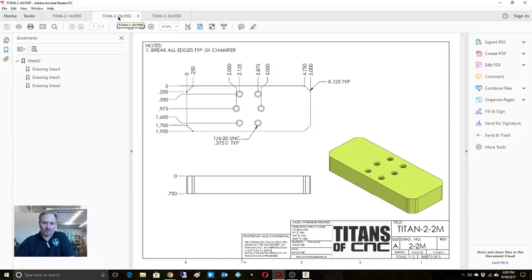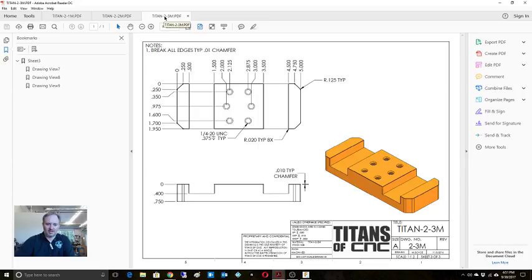Step 2, we go in and we're adding to that drawing. Now we're adding in the holes here. It looks like it's drilled and tapped, 1/4 inch, so 1/4-20. We're going down 3/8 of an inch. So it doesn't look too bad at all. And the last one is to put these slots in.